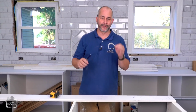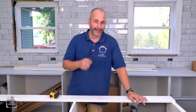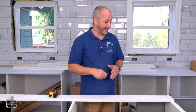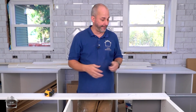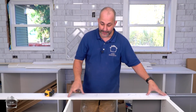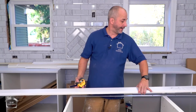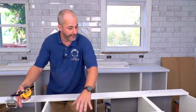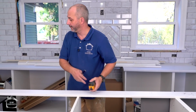That's another consideration. When it comes to actually laying this out, I'm going to use the Ikea cabinet system as my guideline because it's important. The timeline for building an island like this can actually be just around about a week, week and a half. I know that sounds crazy, but the truth is, you can put all your flooring in, have all your lighting done, have the paint done, grab your cabinets, stick them together, and then just grab a couple of 1x5s like this, okay? And you can line it up on your cabinet and extend it out, all right? And it'll give you a good representation of where your counter is going to go.